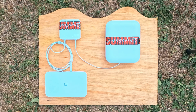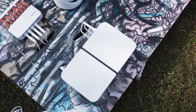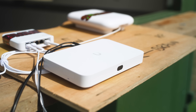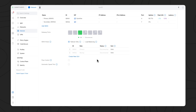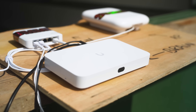For the brain, I built it all on this wooden board and I had my friend Adam, who at the time was painting the bar, do some design on it just to give it a nice little bit of edge. At the core is the Cloud Gateway Fibre — a relatively new but really high-end bit of kit. This can run UniFi Network, Access, and Protect, and it's also the router for your network. It's really versatile with its PoE port which can be remapped to WAN, and that's what we did, meaning I can power the internet receiver on top of the bar that's bringing the internet in from the villager directly from the Cloud Gateway Fibre.